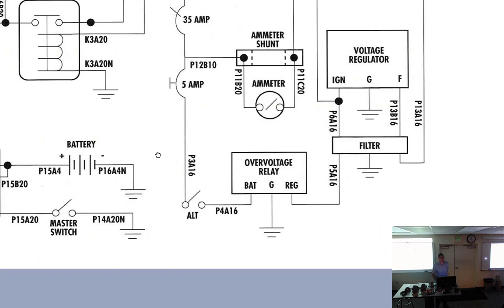It's the dual light. It says over voltage, but they're depending on you to know that it's not really over voltage, because it's the battery, and the battery can't put out too much voltage. Is it just an indication that it works? I think it's a double indication. One, the bulb is on, and two, it lets you know your alternator's off, which is kind of a funny thing. Then as soon as you start up the aircraft, the light goes off. But now you're flying the aircraft. If the light comes back on, that means you've got over voltage.